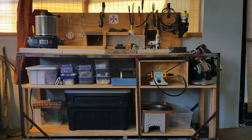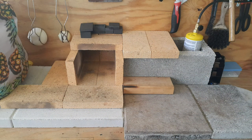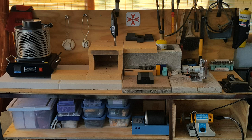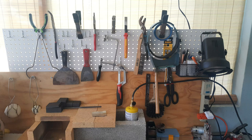First, the bench itself. The frame is made of steel angle iron with plywood shelving. Because of the nature of the molten metals involved, the top shelf is covered with landscape bricks to provide a safety barrier between any accidental spills and the rest of my tools and equipment. I've also added high temperature fire-rated bricks where the actual pouring and torch heating of molds is done. I further use these fire-rated bricks to create a semi-enclosed oven-like area to increase heat retention when melting silver using small ceramic crucibles or warming up molds. A plywood backing prevents any splatter from leaving the bench area. A cinder block creates a great elevated shelf for graphite molds and a safe place to keep the map gas bottle. A pegboard was added to the back for conveniently hanging tools that need to be at hand.